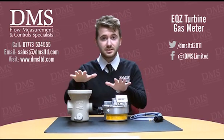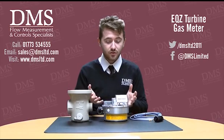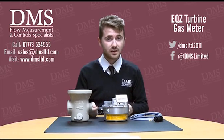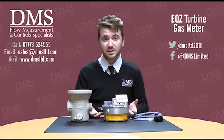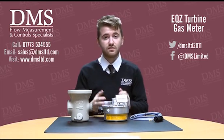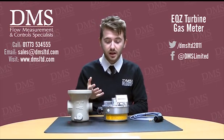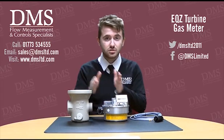The benefit of having a meter such as this is that for recalibration, the meter can be removed from the pipework without having to undo the bolts of the flanges themselves. You can also get replacement heads if there are design changes, flow increases, or anything along those lines. The meters can be supplied with a different number of these heads to suit the bodies.